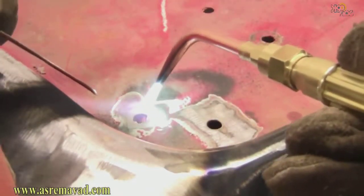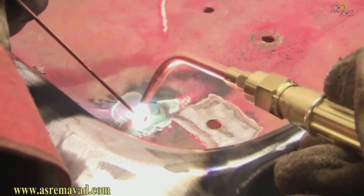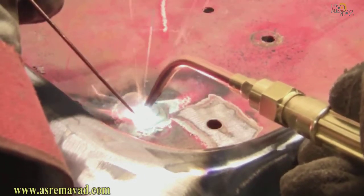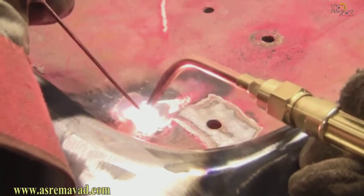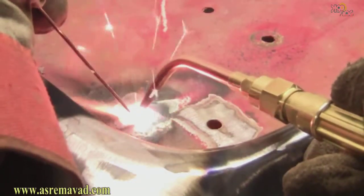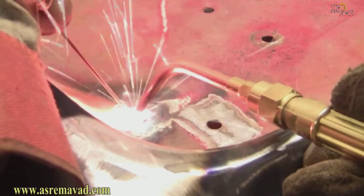But oxygen is an oxidizer, and when you put it with something that's kind of flammable, you have something that's really flammable. And that's something you can see, like, if you're cutting something out in the field and the grass underneath it's on fire, which you shouldn't do, but let's face it, most of us have. When you press the lever for the cutting oxygen, then the flames underneath whatever swell right up.